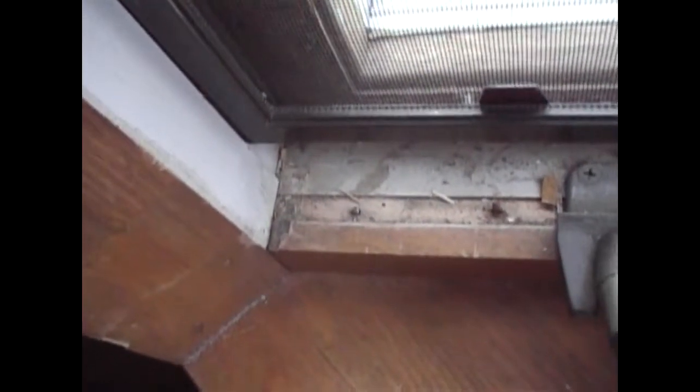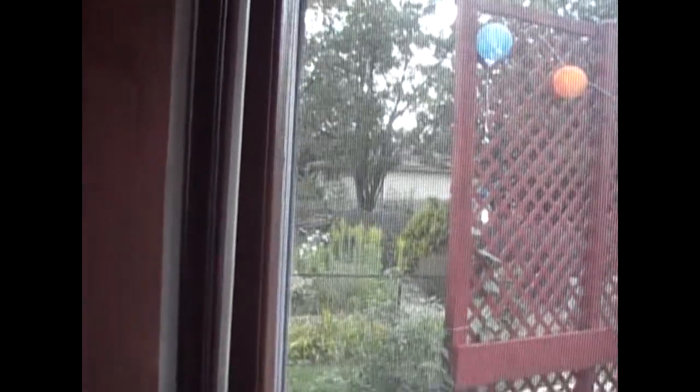And when I'd come over and measure this thing, and then I'd go home, and I've got a CAD system, and I'd go to draw it, nothing was coming out right. The gap that I have here when I went to draw this was all wrong. What they did here is they actually mortised this side piece into the window. So once I discovered that and factored that into my dimensions, everything started coming out the way it's supposed to. So we're going to do this weekend.